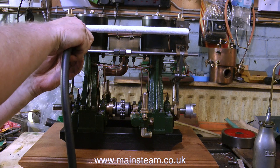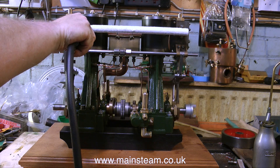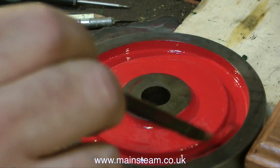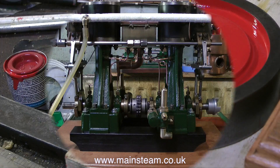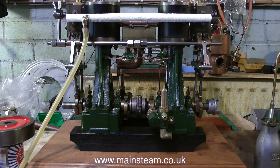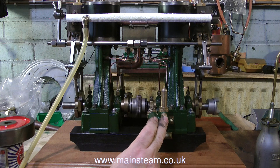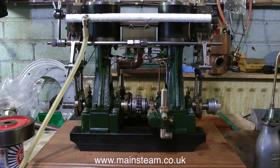Look, it even runs without a flywheel, and it runs very sweetly. While you're all watching in amazement at the engine, there's some painting — I'm finishing off the flywheel. I've done the other side, I'm just putting some paint on the backside of the flywheel. As soon as the paint's dry on this flywheel, it can go back on the engine. Before reassembling the pumps, I put some steam oil into the cylinder part of the pump, just to seal it. And now by putting my finger over the inlet or the outlet, I can feel a pulse — so that means the pumps are going to be working fine on water. That's it for now, thanks for watching, I hope you found it useful.